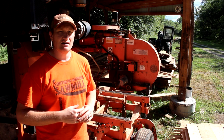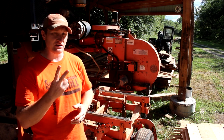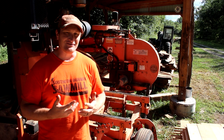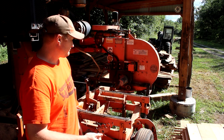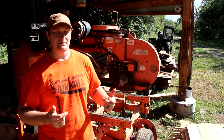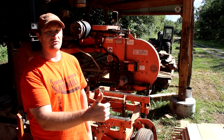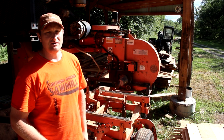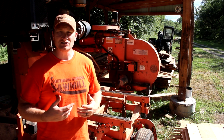I was out on the job site last week on a two-day job. About the last hour of the second day, my guide arm — on the switch on my control panel — would push the guide arm in, but when I went to push it out it wouldn't go. I ended up using the switch to bring it in and then coming around to manually push it out, which was a real bear because there's a gearbox in there.